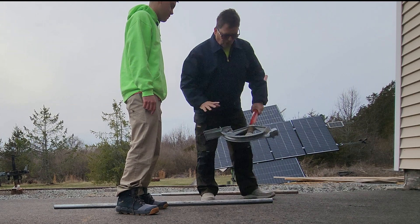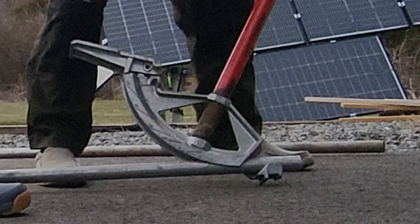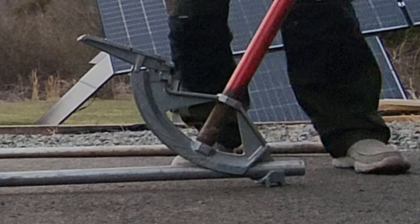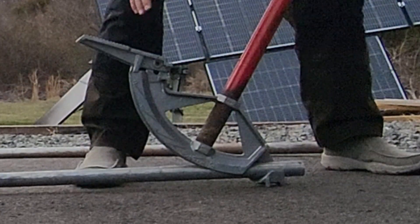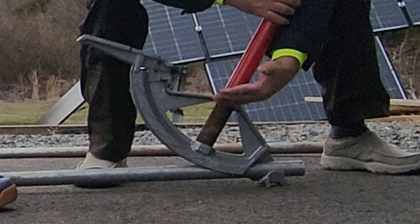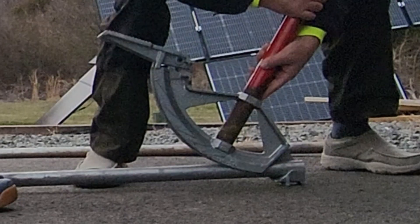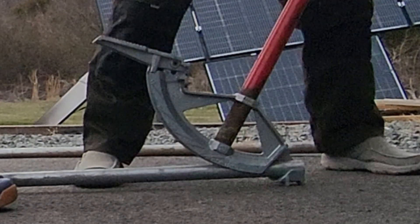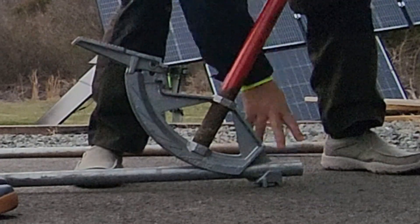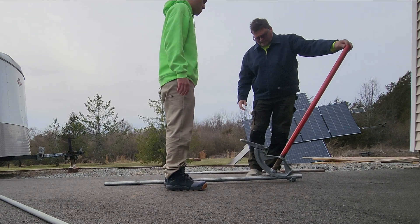If you don't have a measurement, you can use the arrow — it's just easier. We're going to go approximately two inches beyond the shoe. We don't want much more than that. Whenever we're bending conduit, it's actually going to shrink because of that 90 and the force of the metal. You never want to be too far on the edge, because then you might run out of the shoe as you're bending. That's why I like to leave about two inches — right about here.